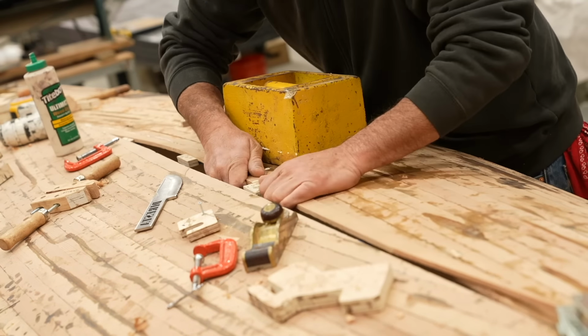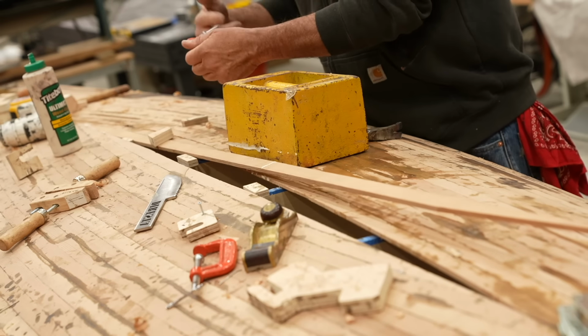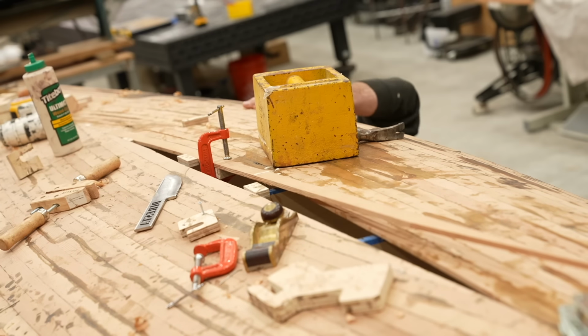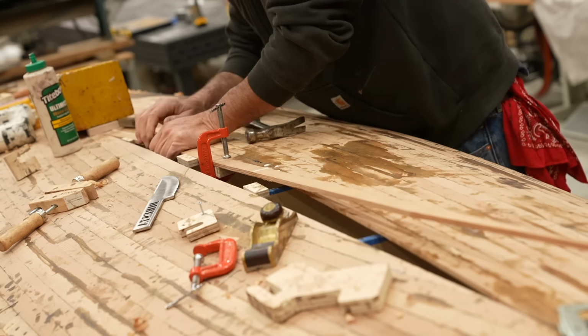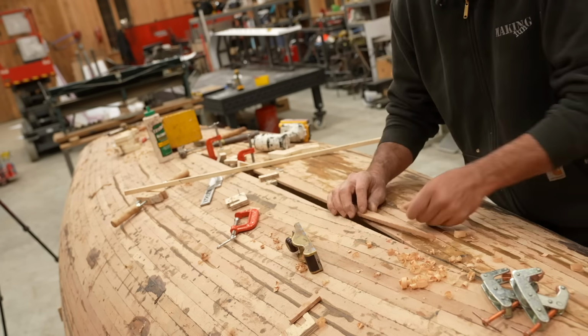And you see, I couldn't make that severe bend without having those chocks that are right there. And that would be the whiskey plank where those chocks are. They call it the whiskey plank because you put it in, then you're so drained from doing this that you have to have a glass of whiskey. Nick sent me a message and said that he was sorry that he had missed the whiskey plank. But that was fine.